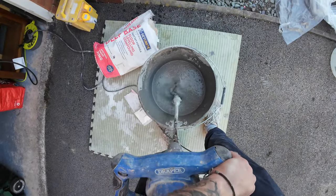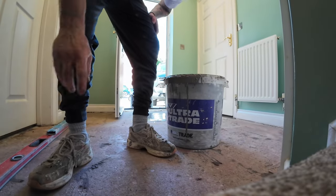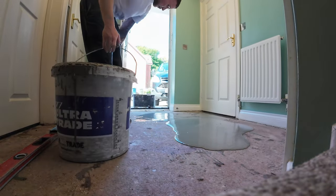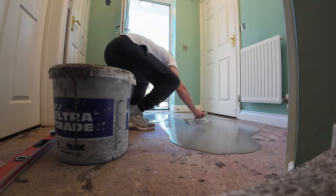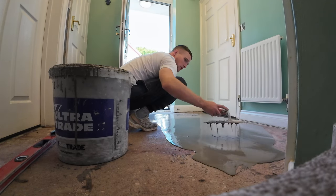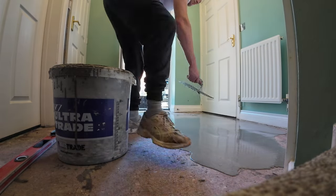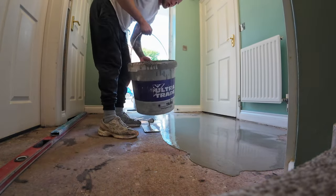As you can see it's a really liquidy texture. We're going to do about two minutes of mixing until it's fully mixed, then go pour it. We know that our dip is in the center of the floor and we've already wiped it all out. It's a Saturday job so we're just getting everything prepped ready for tiling — at some point I'll go into more detail if you're interested. We'll use a float to push it and encourage it to go into the wider parts of the room, and because it's self-leveling it will just naturally level out.